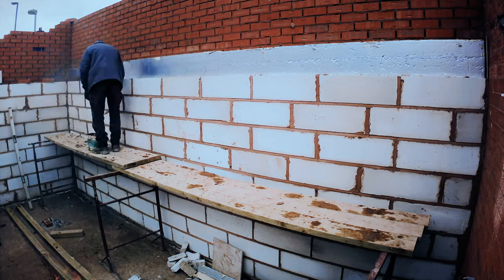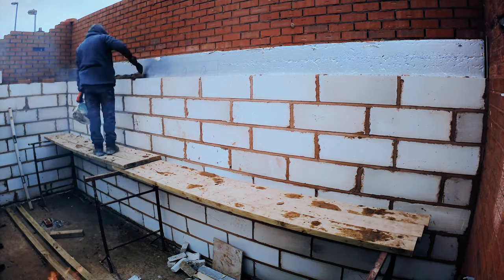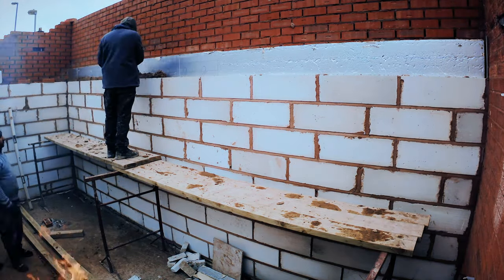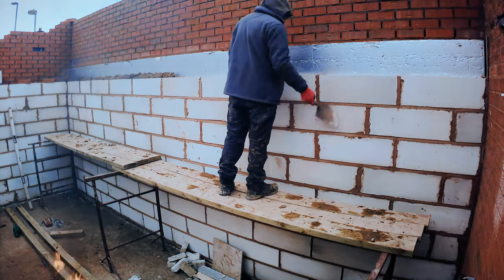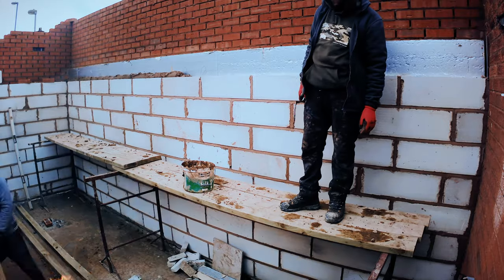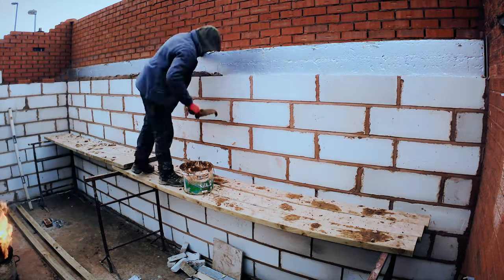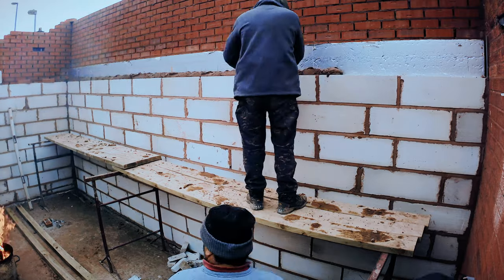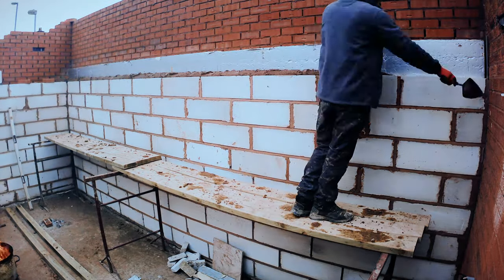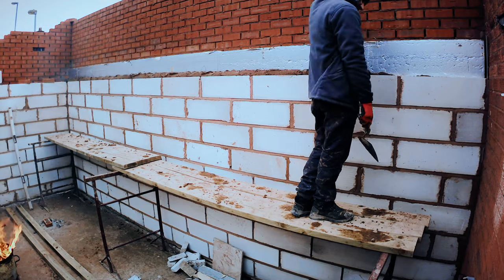But basically, they get a bed of mortar, so sand and cement mix. It goes on the inner wall. The inner wall is the block wall, and that's where the wall plate will be attached to. When I say attached, we'll actually have metal brackets which screw into the wall. The reason they have that is if there's ever a storm, there have been storms in the past in this area where the roofs have been ripped off the ceiling.